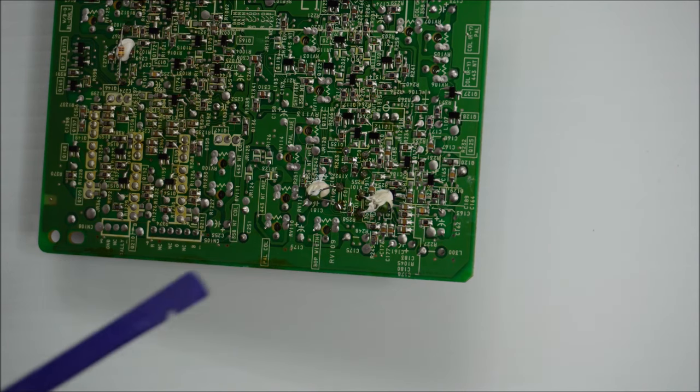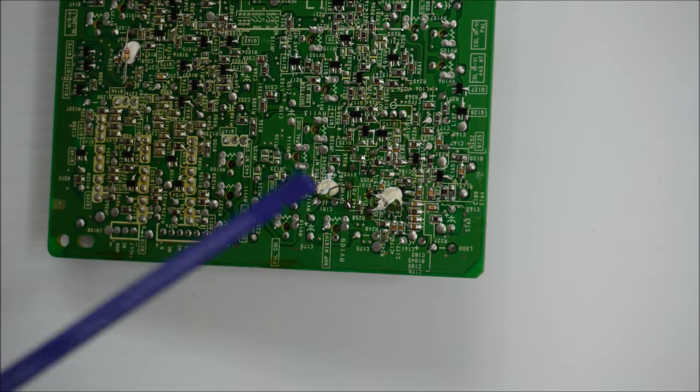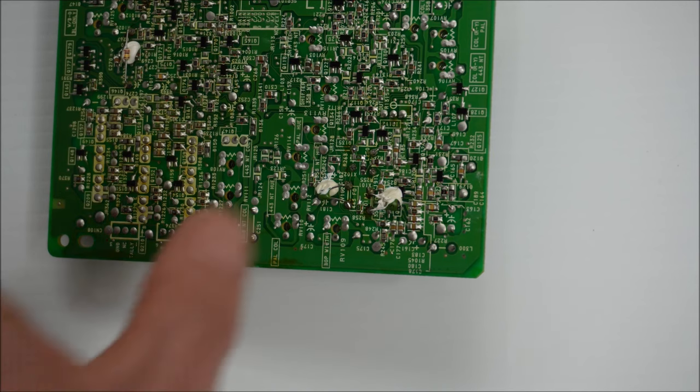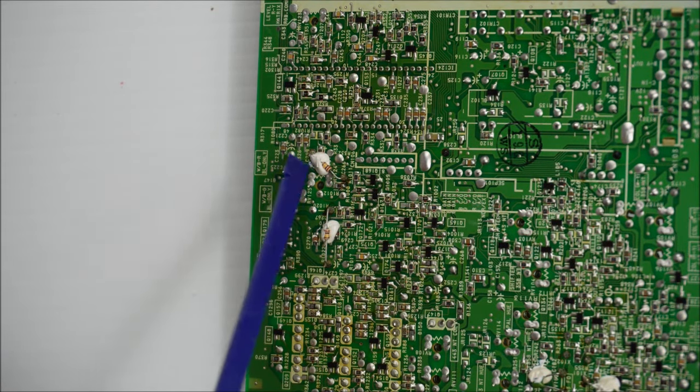The ceramic capacitors are soldered in there and there and held down with some adhesive of some sort. This is not totally uncommon for manufacturers to fix problems like this. It's a bodge job, but it's probably easier than re-kitting their construction lines or redesigning the PCB to accommodate the new parts. Rather, they just solder them on direct and secure them that way. You can also see something else Sony's done here too. There's a couple of resistors added. So it's not necessarily from an end user doing their repair themselves. It can come from factory like this.